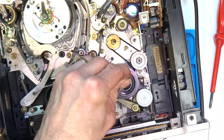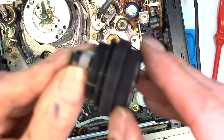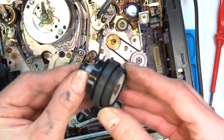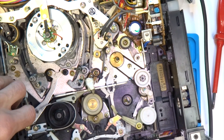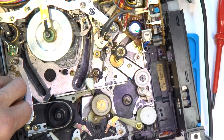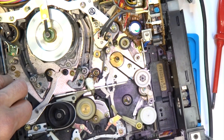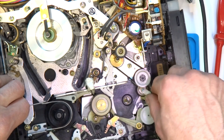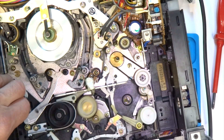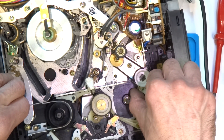After removing some plastic washers on the take-up spool I removed it to have a look. It still feels quite rough, so it's got a good surface for the idler to go up against. Next up it's time to trick the machine into play. I've got some tape over the LED sensor in the middle, and there's a little tab down the bottom left I've pressed to trick it into play, just to see what the idler does. As you can see it started going around and then it stopped — so there definitely seems to be an issue on that side of things. There just doesn't seem to be enough resistance there to drive the take-up spool, let alone pull cassette tape around, even with the help of the capstan motor.